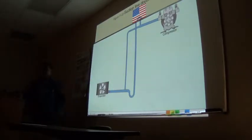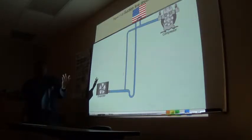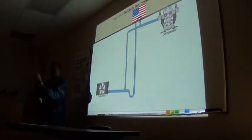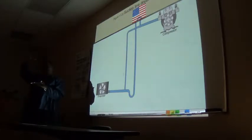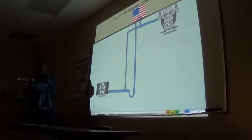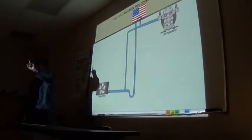With the suction line, you can increase the size of the line, but you're going to end up getting lower than normal pressure in that line. And you'd be thinking, hey, I should be reading 25 psig here, but I'm reading 20. So I need to add more gas to bring this up by 5 psig. But you're already at full charge, and the only reason it's reading 20 is because you increased the size of the line. So in this case, maintain the same size throughout.